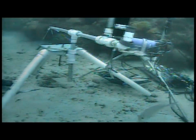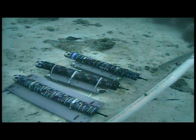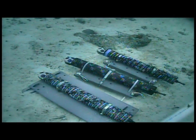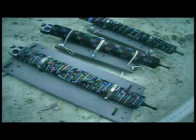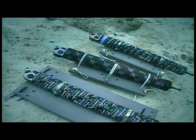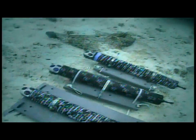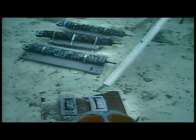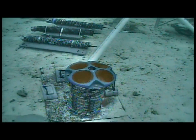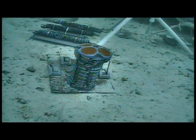If you go to the left from there, a little bit more, you'll see our Aquadop sensors. The little heads on the left with the triple sensor heads are capable of measuring current velocities and directions as you go up from the seafloor into the water column. A little further to the left is an ADCP, an acoustic Doppler current profiler instrument, with four heads. We had 17 instruments out cabled on this mission.